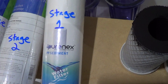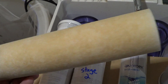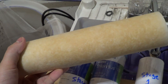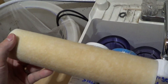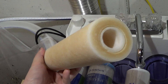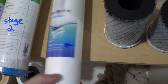The first stage is just your typical sediment filter, rated at one micron to remove sand, silt, dirt, and rust particles from your water. This is what my old one looks like after three months of use, which isn't that bad — it's actually in pretty good shape. If your water or pipes have a lot of rust, this would be much more rust-colored. I'm going to replace it anyway, because the longer you let it go, sediment particles build up and your flow rate is reduced. So this one's getting retired, and this brand new white one is going in as my first stage.